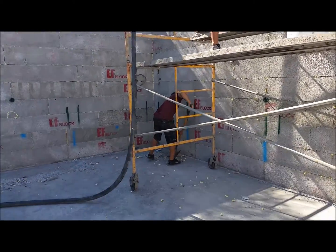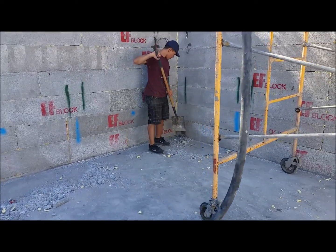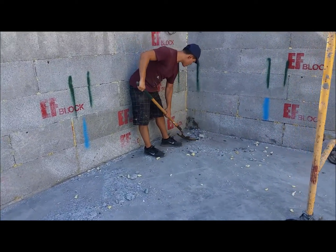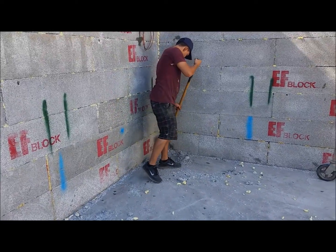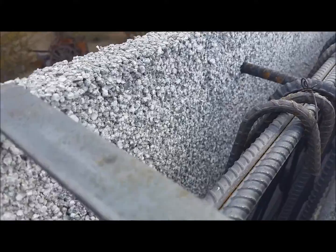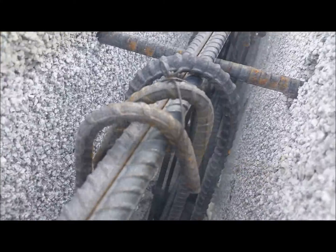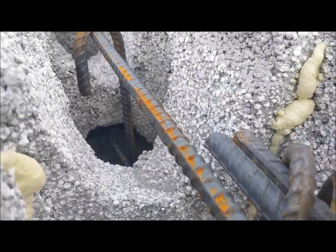You never want to put water on the floor. What we don't do is sweep up the floor while we're working, and then when we grout, that acts as a sweeping compound so the grout doesn't stick to the floor. This is a bond beam and lintel here — a lot of steel in there, nice clean job.